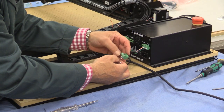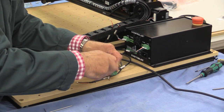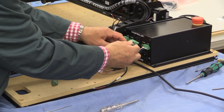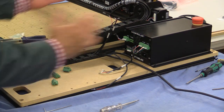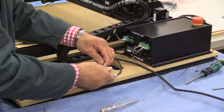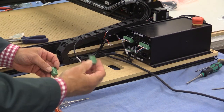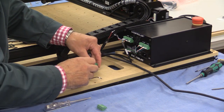Wiring up these terminal blocks is pretty straightforward. Just take your time and make sure you get the colours in the right order, and then the rest is very, very easy. Now, the ones to really watch are the two Y cables — they're numbered Y1 and Y2. Make sure that the one labelled Y2 goes to Y2, because otherwise you might have one motor going in one direction and one in the other. Just make sure you get the Ys the right way around. Always check what's on the label — Y1, Y1. Now, when you're wiring up the limit switches, there are two blocks: one's got eight connections, the other's got seven. Don't do what I just did — start putting the limit switches on the one with seven, because that's wrong. You need to put the limit switches on the one with eight. One only notices that sort of thing towards the very end.